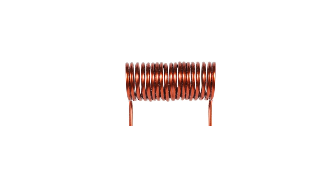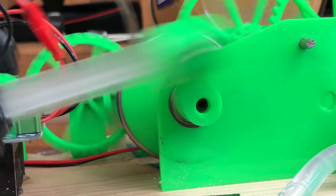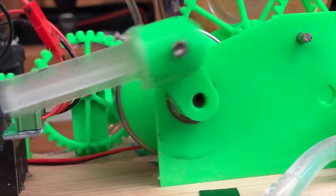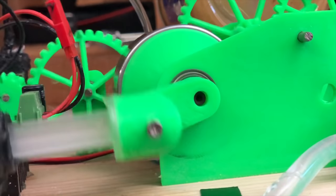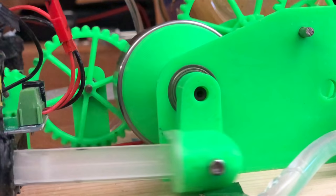The active zones are where we can control the force on the magnet and the direction of that force by changing the polarity. To be honest, I have no idea if the long stroke method is actually any better since I've never built a normal one. I went with the long stroke version because I felt like it might have a bit more torque with lower crank speeds. This is because the lever arm of the crank is longer.